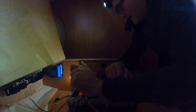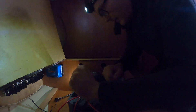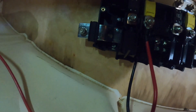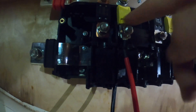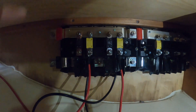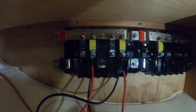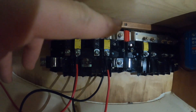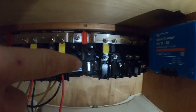Now we've got the MPPT positive and negative — let's just take them out, run them over, and tidy the cables up. The negative goes right in behind these flaps here, and the positive just clips in there. Both positives and negatives for both MPPTs are coming through here. The middle one is a 60 amp fuse going to this unit, and on the far side is the house load.